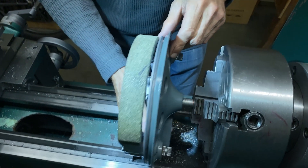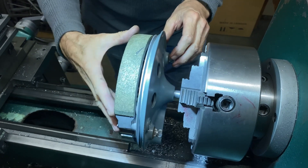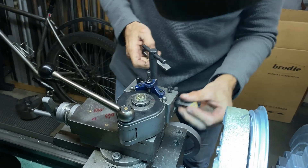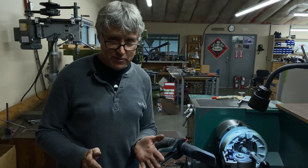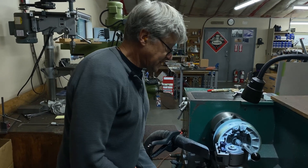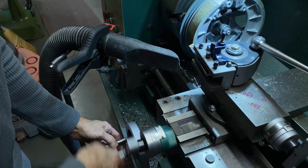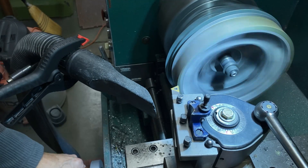There goes the backing plate like that. See how this part of the backing plate is going to rest up against the chuck. Then we put the spacers on. I've got a carbide tool bit. We're going to take the first cut. I'm a little bit nervous, to be honest — I hope everything goes right, nothing goes wrong. So I'm going to take small cuts, probably 10 thou at a time. We've got a vacuum here to take off the dust. We've got a slower speed — we'll see how this works. Feed engaged, here we go.